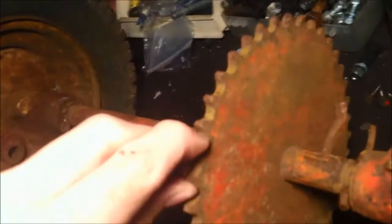This is a 40-toothed sprocket here. I'm going to weld on this side and reinforce it. Not sure what pitch chain it takes — I think about 35 pitch chain — but I'm going to try to put 40 or 41 on it. If I had to modify the tooth, I probably can. I can always put a different sprocket on that or rig something up. I'll be using this probably. I just need to sand it down and repaint it — obviously a little rusty. This will be the spool itself. I'll weld some washers on here to keep the cable from walking everywhere, but there's still a bunch of little stuff to work out.